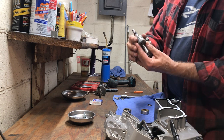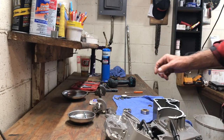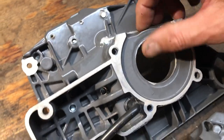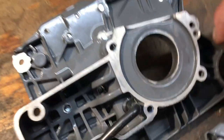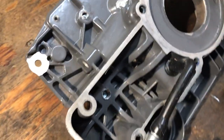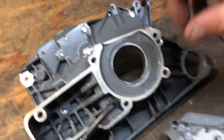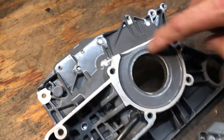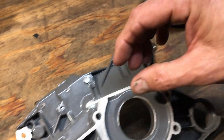We'll probably clean up the casting on the crankshaft a little bit. One last thing I noticed — this paint really isn't bonded very well at all to any of these surfaces; it just flakes right off. You can see right there. We may put a little paint thinner or some paint remover on it and get all of this paint off, because I don't want it chipping off afterwards. Bearings don't like to have any kind of debris in them.